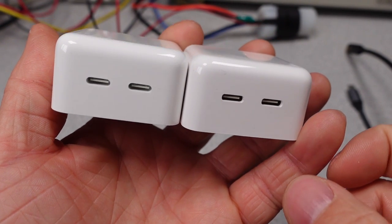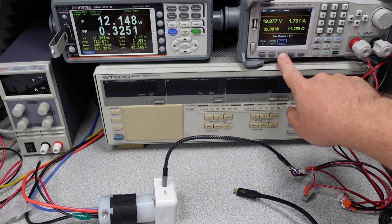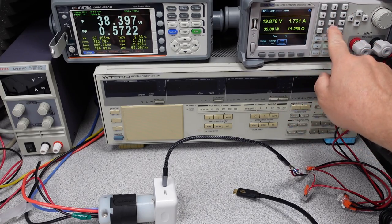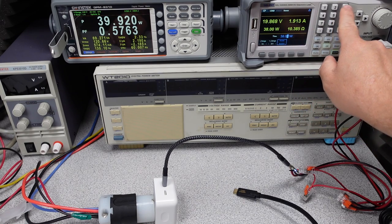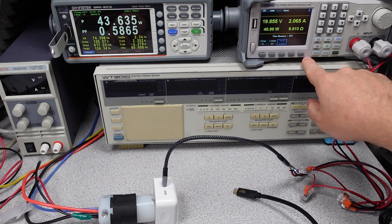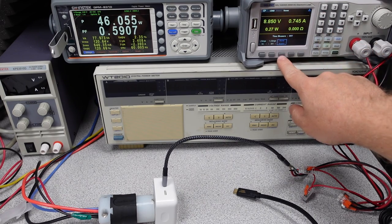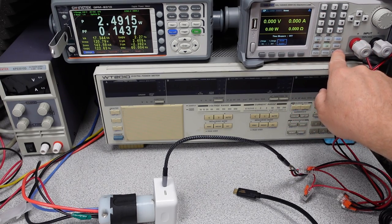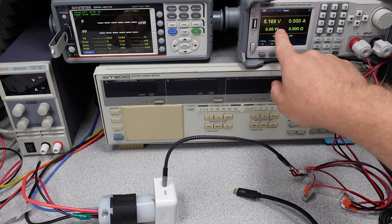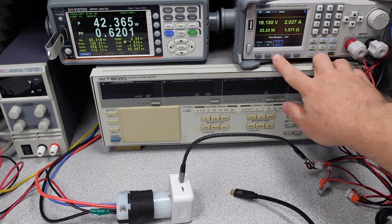The casing of these adapters never really got too hot to the touch during full load testing. Now it's time to take this power adapter up to overload — that is, how much output power beyond its range before it safely shuts down. Let's see how far I can push it: 36 watts, 38 watts, 39 watts, 40 watts, and 44 watts — and the device tripped off. This is a safe overload threshold. The power adapter does recover to 5 volts once the load is turned off, so the cable can be left in place. The Kukat, just for comparison, tripped out at 39 watts.